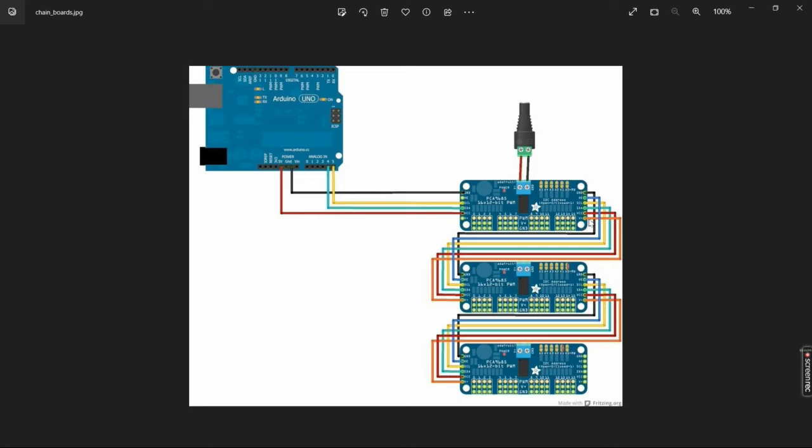The V plus on the bottom is the 5-volt input to drive the servos, the actual power supply. And so that carries on that connection to each board, so you don't need to add multiple connections on the blue or green header pins. Just make the first one. So that's just a basic look at the layout of the boards.